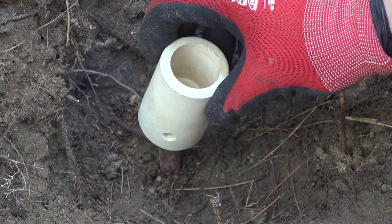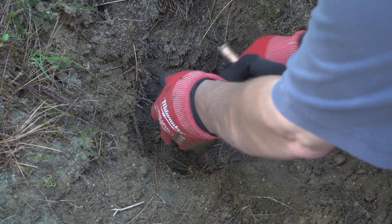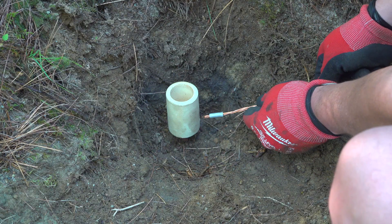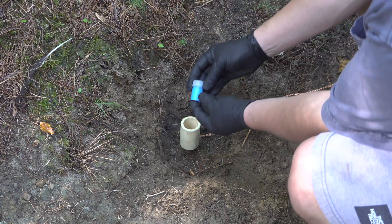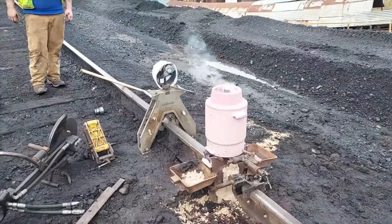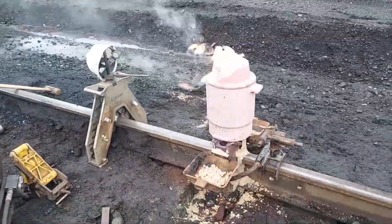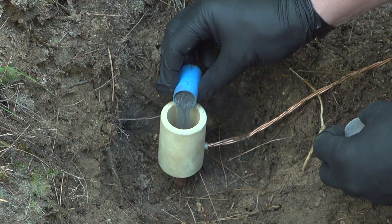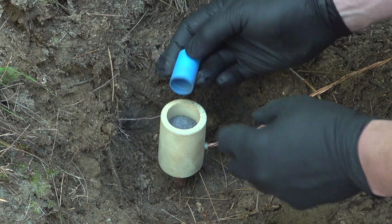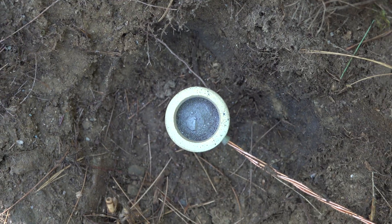Remember that grounding rod will last way beyond your equipment. This small crucible has two holes in it. The first one goes over the rod itself — that's why it's critical to cut that mushroom off so you can slide this thing over. It's also got a hole on the side where we insert our copper grounding wire. You slide your copper wire in and the wire is right on top of the rod. The kit includes a small capsule filled with some sort of powder — it's not gunpowder, but there is definitely a flammable material in it, very similar to what you may have seen in videos on how they repair railroad tracks. When lit, it gets so hot it becomes molten and encompasses both the grounding wire and the rod itself. Next, insert the metal disc included in the kit, then open the capsule of powder and pour it in. The very final powder at the bottom is actually the igniter.